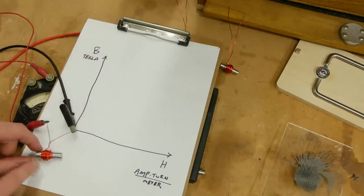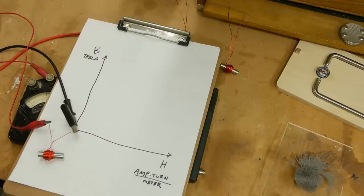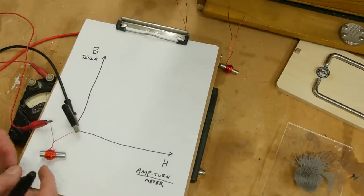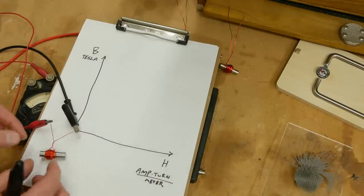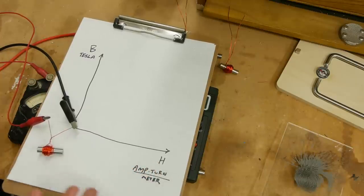If we put more current through the coil we get more teslas out. Turning it up slowly, as the current goes up we get more teslas: about 30 millitesla at 8 amps, about 20 millitesla at 5 amps. The input to our system is the current through the wire and the output is the number of teslas we get out. As it turns out, the input to the electromagnet is the number of turns times the current divided by the length of the coil. One turn at a certain current is the same thing as two turns at half the current — you couldn't tell the difference from inside the coil. The unit is amp-turns per meter, where the meter is the length of the coil.